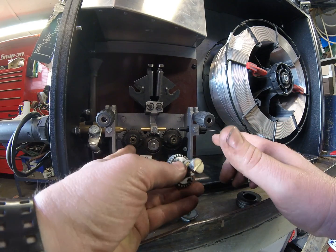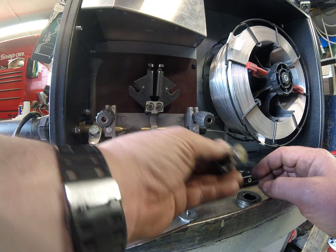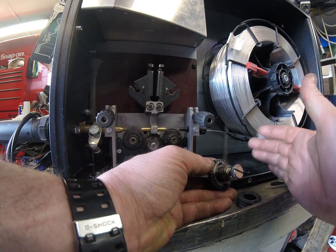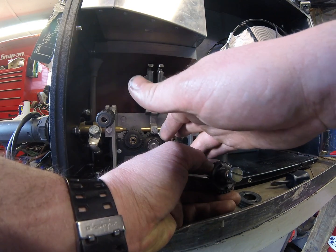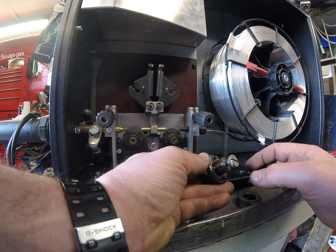We have four gear carriers. The bottom ones stay put. The top ones have to be added if you decide you want to run aluminium wire. The normal configuration for solid wire would be V-groove drive rollers and plain pressure rollers, which I'll cover in another video.